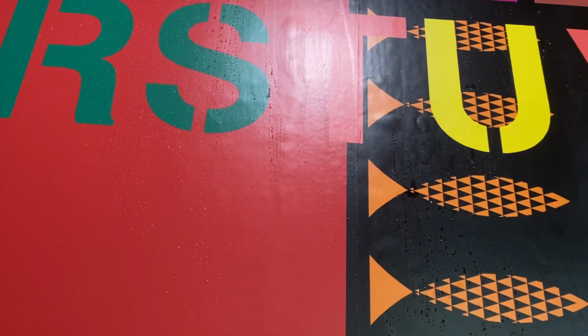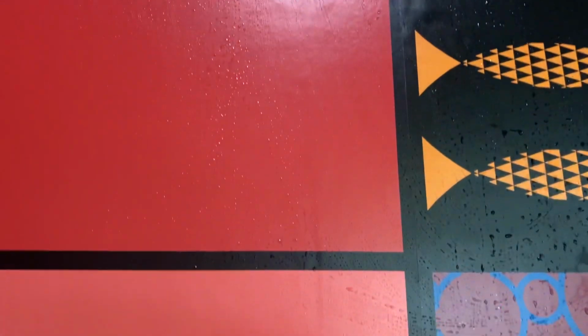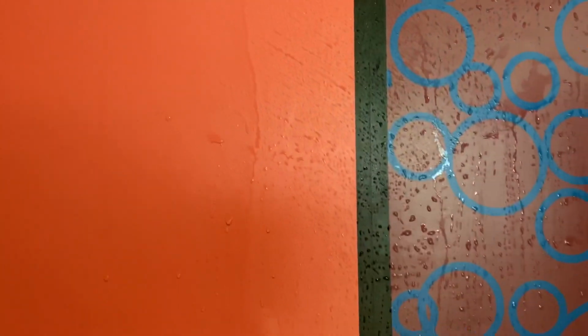That's number one. Two, heat if necessary. And three, busting the seam within a reasonable amount of time after joining the wall covering. You're looking at a seam right here. That's a seam. Cut with a single edge blade. This is eye level, 5.5, 6 feet from the ground. Now, if I had done this with a 9mm blade, the results would be different. So for this product, I would recommend the single edge blade.